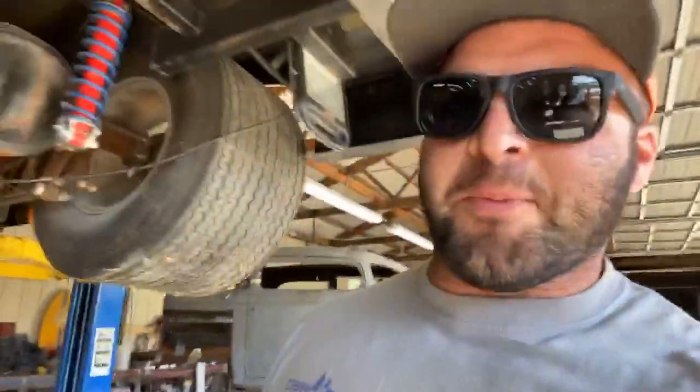This new welder is called a Trailblazer 302 air pack. I made a video about it about a month or so ago when I bought it. I got a killer deal on it. I've heard 12,000 to 15,000 brand new. But anyway, it's because it's got a built-in air compressor. It has a battery charger, does 12 and 24 volt, which is really nice. You can jump start your big 24 volt stuff like your excavators, dozers, whatever.